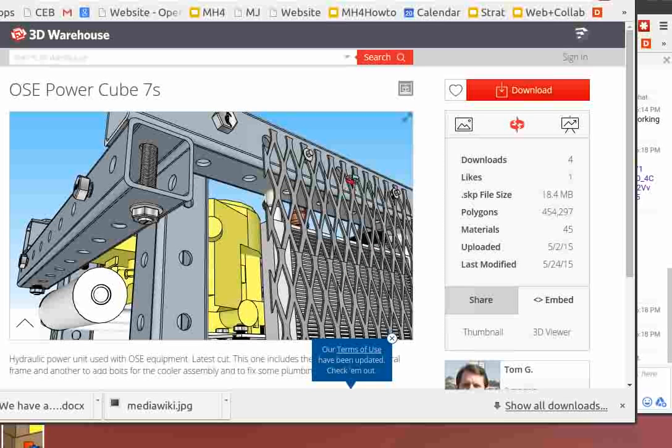Right. I could see that expanded steel is pretty strong, so I would use bigger bolts. Can we just use even 3/4? Because imagine a case where you put a lot of pressure on that expanded steel. Those bolts are going to rip right out if they're 3/8. So I think it would be good to just use thicker bolts there. If you have bigger washers too, they'll really grab onto the expanded mesh.